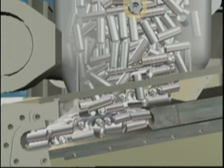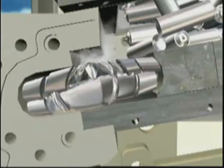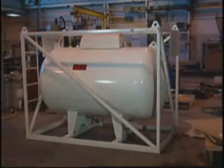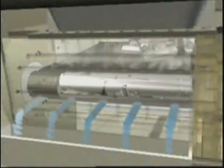The Stage 1 RAM crushes the cans using 4,500 PSI, releasing most of the liquid and the propellant gas. The propellant is drawn off and recompressed into a holding tank for recycling or incineration. The liquid goes to the bottom and is pumped into an adjacent holding tank for recycling.